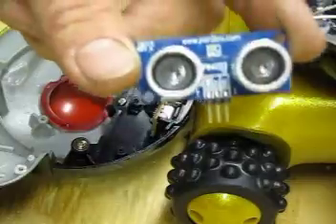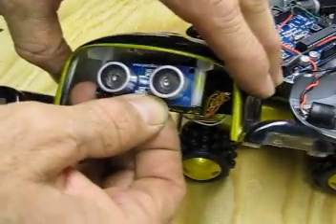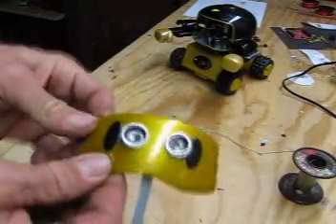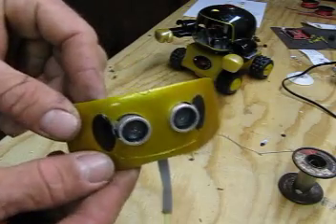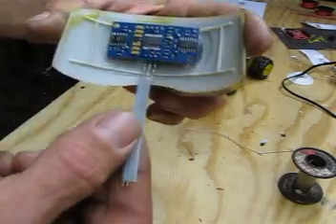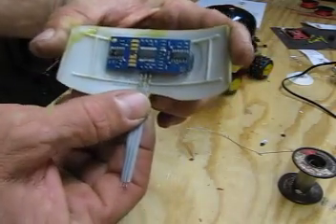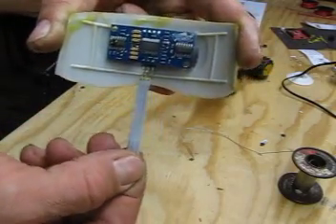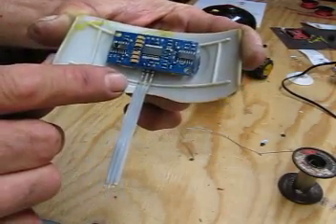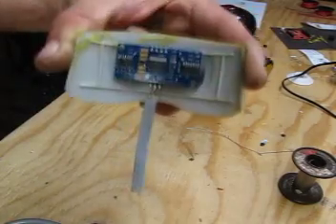Now we need to put this thing in the robot so it can see. I'm thinking it might go good in the face, mounted like this. I have the face plate with the ping sensor stuck in there with some super glue — a few drops around the eyes and some on the back, and it's glued in quite sturdy. I reused the ribbon cable that used to go to the head of the Rumble robot; it had 4 leads and we stripped it back to 3, which is convenient since the Parallax sensor has 3 leads. Now we'll get those leads down to the Arduino board and mount this baby up.